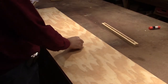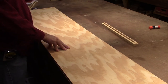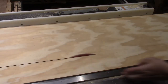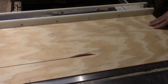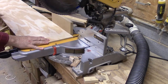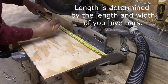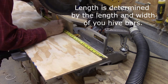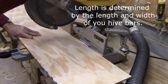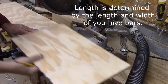This is a piece of 3/8 plywood — it's the scrap that I have — and I'm going to start by ripping it to 12 inches. This will be enough for all of my side pieces. Now I'm going to get all my sides cut to length.